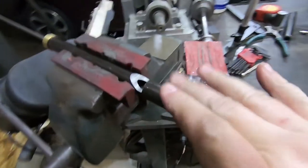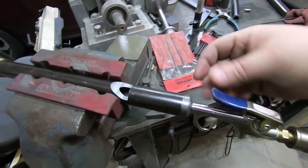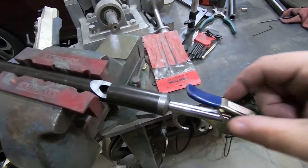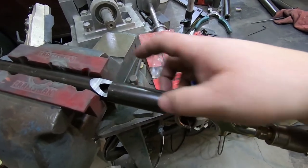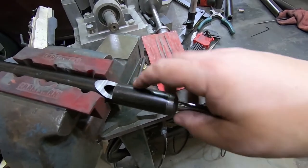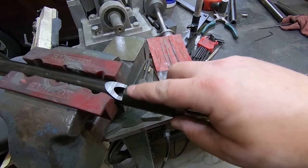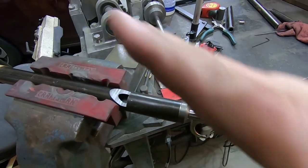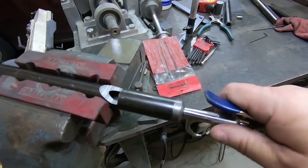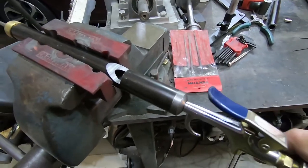It's a little bit weedier this time. I'm not sure why, possibly because when I had the previous temporary blower on, the aperture was back here, so maybe the air had more time to expand before hitting the baffle. Maybe we're getting a lot of turbulence up in there. I might try filing down one side of the baffle to channel the air more smoothly in there. Not sure if that would help or not. It's kind of bugging me, though.